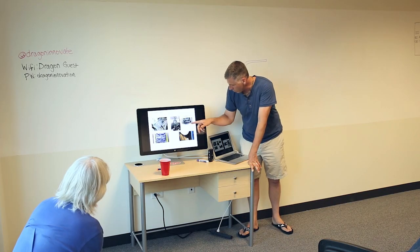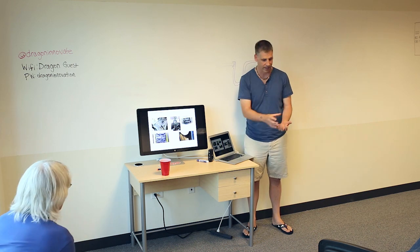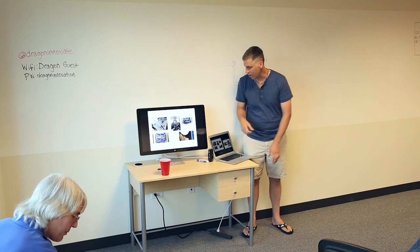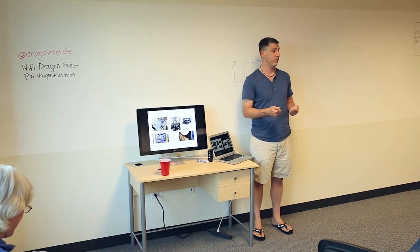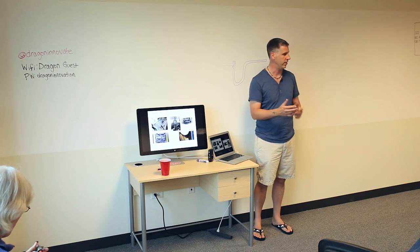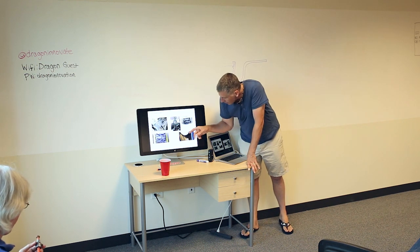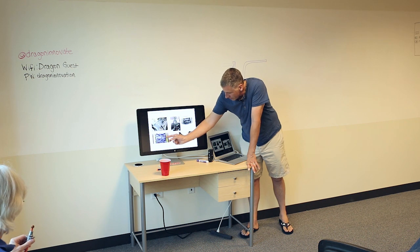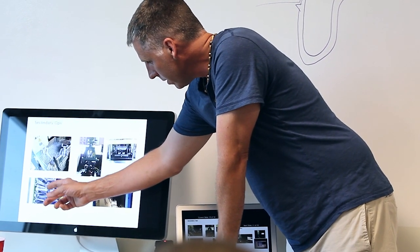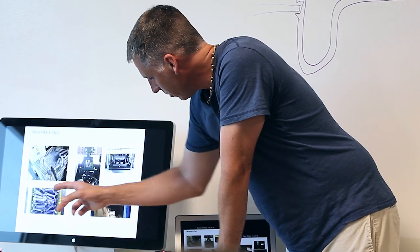This is a die trimmer where you put the shot in here, and then it's just a stamping machine to trim off the flash. All die-cast parts are going to have significant flash, so you need a way to trim it. And it's like a razor blade, so if you don't, it's incredibly dangerous. Here's just a bunch of crankshafts, pistons that were shot, and then here's some CNCing that you can do to it.